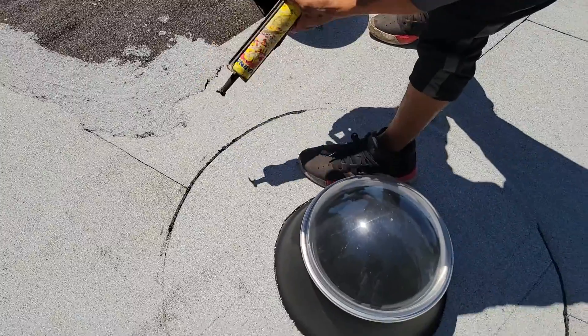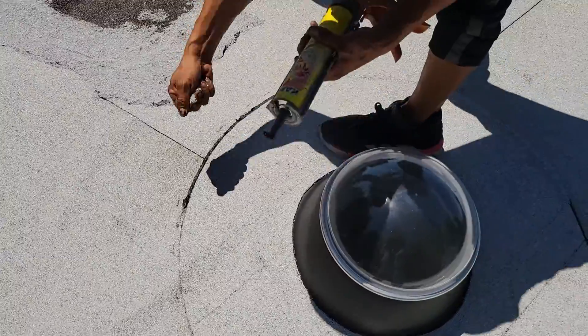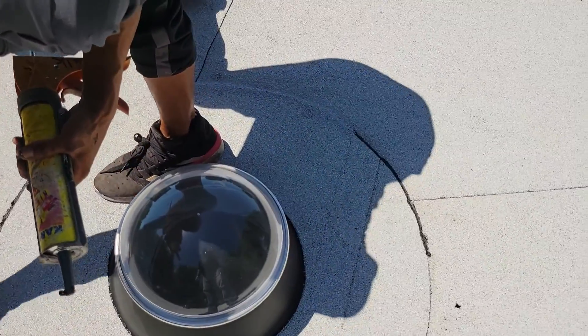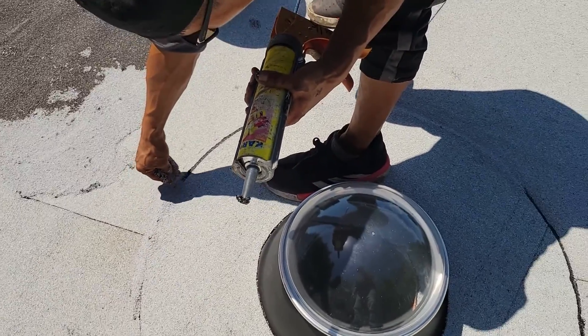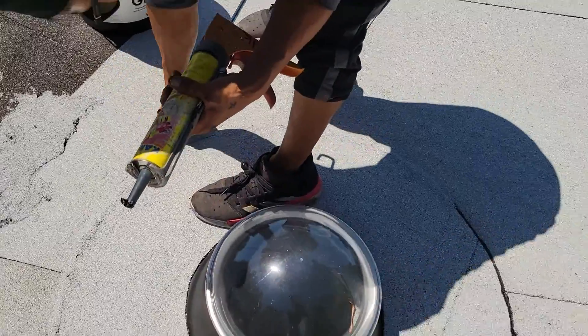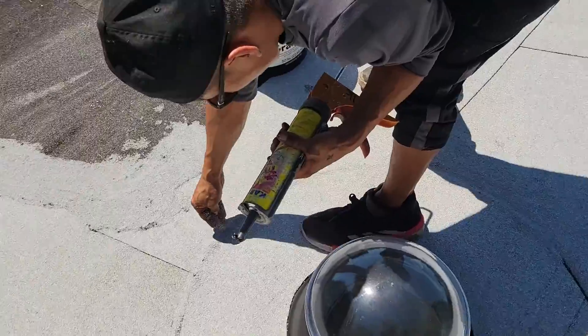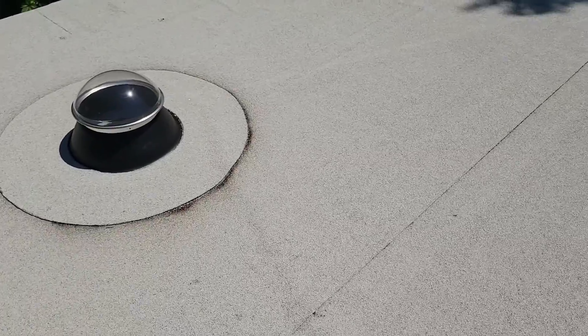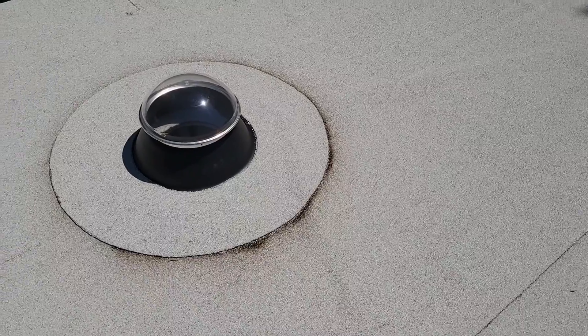Added little stuff that I do on these — that's the Karnak Ultra 19, or E-modified adhesive, on these targets. Makes it nice and pretty. You just take the modified roofing cement in a tube, run a nice pretty bead right around on the top sides of where the water's coming down against the targets. We'll do both of these like that, and we don't have to worry about any water getting back underneath that target.